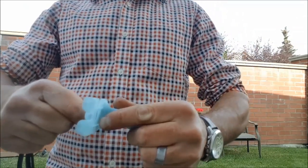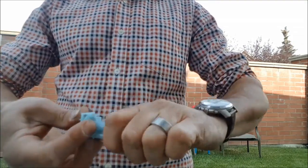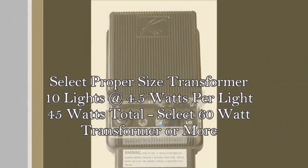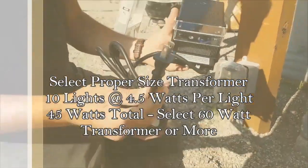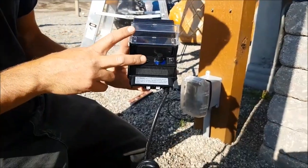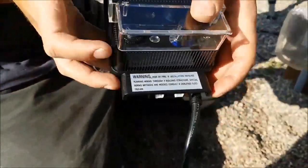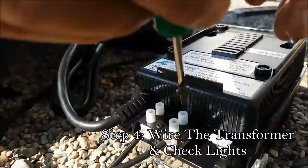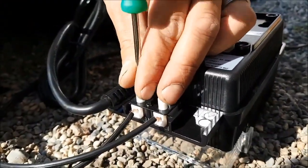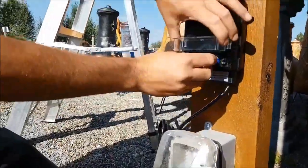The wire feeds into a gel-filled tube that keeps the water out. Be sure you're getting good waterproof connections that keep the wires free of the elements as well as keep them from pulling apart. The next step is selecting your transformer — very easy to do. If you look on any bulb that you purchase, it should give you the wattage. If you have a 4.5-watt bulb and you have 10 of those, that's going to give you 45 watts, which means you want to select a transformer that's just slightly bigger than that. I recommend trying to find a transformer that has a photocell as well as a timer built into it for easy use. It's very easy to wire in your transformer — it's generally going to have a common tap and a 12-volt tap. You just put one wire into each tap, screw them down tight, mount your transformer close to your GFCI receptacle so that you can get power, plug it in, turn it on, and go make sure all your lights work before you start burying any wire.